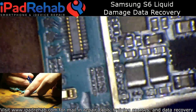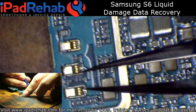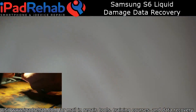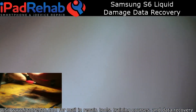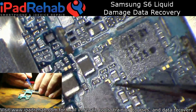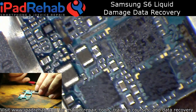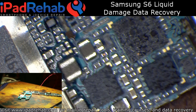I've got 60 milliamps before prompt to boot, and after I prompt it jumps up a little over one amp, and I'm definitely getting some heat right here in this area. So I will probe around.